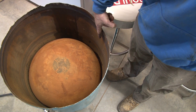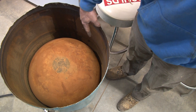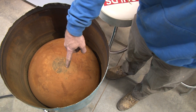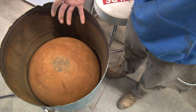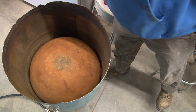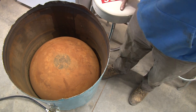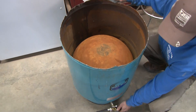That's the culprit of a tank failure right there — there's a hole in the bladder. Over time, water drips down in here on top of the seal where the bladder is sealed to the tank, and fills this whole cavity up. Just wanted to show that so you can have a better idea. This tank only had one hole in the bladder, so it's pretty good for a 20-year-old tank.